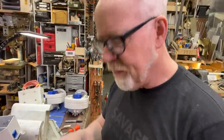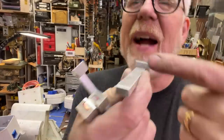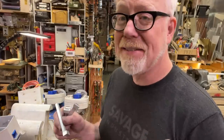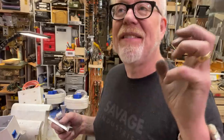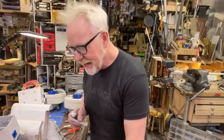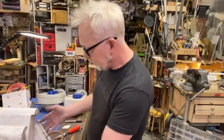So my assembly of the parts of the feet details here, there's not really enough to throw in. I could do a threaded hole with the bottom tap in here and thread it into here. And like, it's not necessary. What I'm doing is I'm pinning everything with brass and then using thread locker to hold it together. And thread locker is made to have a similar mechanical movement as the metal that it's holding. I guess it's probably optimized for steel if I had to hazard a guess, but I'm also going to assume it's fine for aluminum. These things are stationary. They just sit here. I'm going to JB weld them in place and they'll look great.